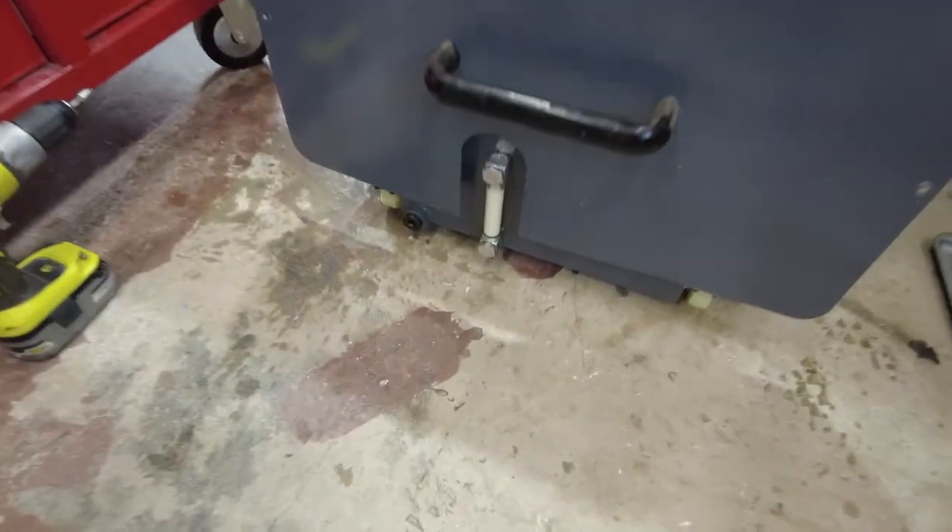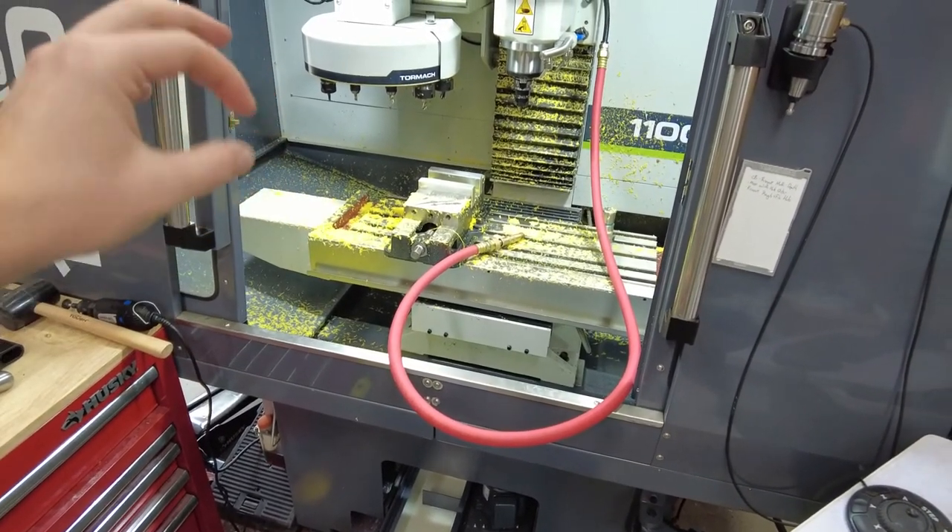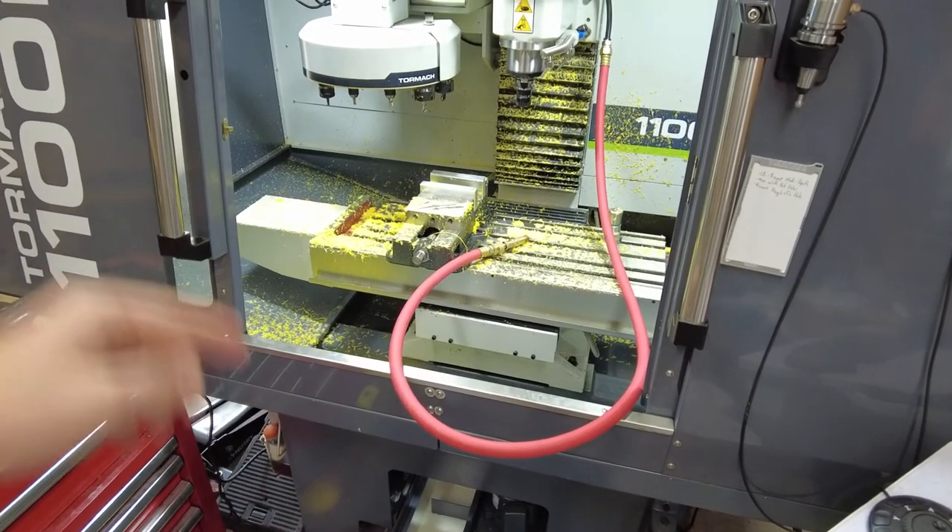I've got her filled to my liking. I checked it and it's at 7% — I want it to be 8%. Once I get this all situated, I'm going to run my pump and add oil a little bit at a time while it's pumping and circulating so I make sure I do emulsify that new oil in with the system. Make sure that percentage does not get too low. If you're below like 5-6%, you're going to start to get rust — that's the main reason you have to pay close attention because any CNC machine will turn into a rust bucket if you have water pouring all over it all day long without enough oil. And if you have too much oil, you get foam — what comes out of the sprayers will be cavitated with a lot of air, which will ruin its cooling properties. I choose 8% and it works for me.